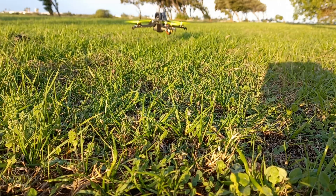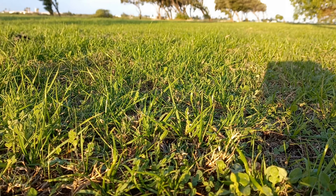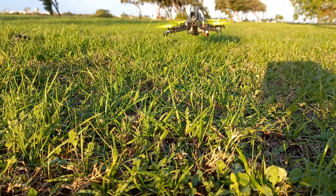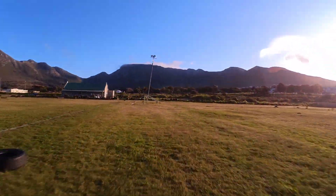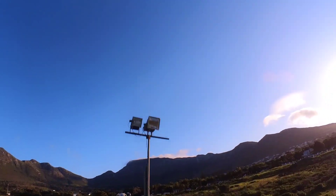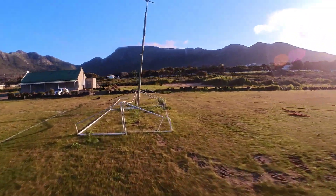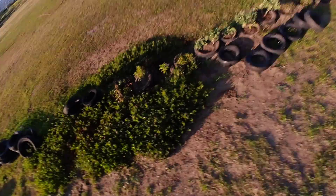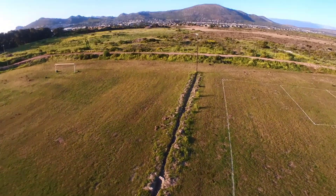The props are somewhat delicate, but not too bad. The next step was tuning and flying the thing. Tuning was reasonably simple — I just turned down some filtering, since the frame has very little resonance, and then turned up the gains a bit to about 1.3. Betaflight 4.3 made this really easy. I'm flying it on a 6S GNB 750 mAh battery, and the quad's not exactly featherweight — it's like 420 grams all-up weight with the battery. But that's pretty good for what I like to do: sort of freestyle, flowy, momentum-based flying in parks.